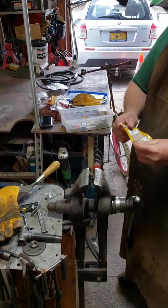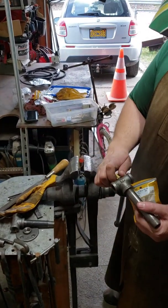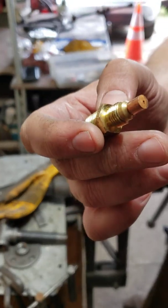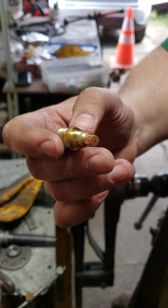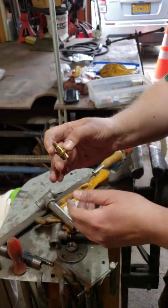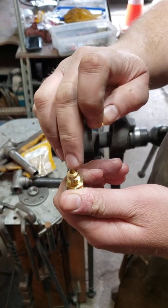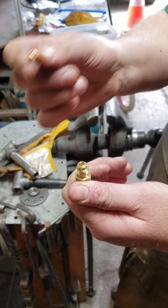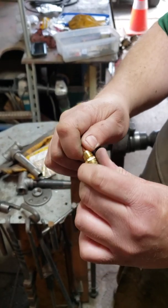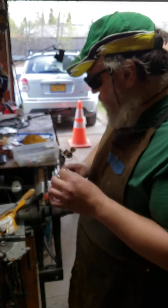The next thing — we're going to build this assembly here. For half inch, that's a 0.025 MIG contact tip and a quarter flare by quarter iron pipe size fitting. Now they normally don't come with a thread right here, so what we're going to have to do is drill and tap that thread to match these MIG tips. The ones I get at Lowe's or Home Depot have got a six millimeter thread on them; some of them have quarter inch threads. So you're going to have to just make it match what you've got.